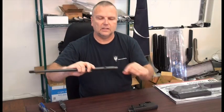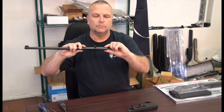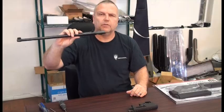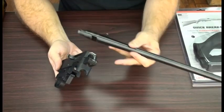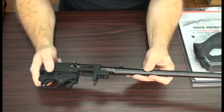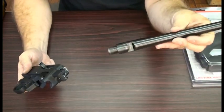After you get the barrel off, you're going to want to take a little acetone and remove any debris that is on this barrel — sometimes a little bit of thread lock compound or something like that on it; you want to remove that. You can also clean any debris from the inside of the action. If it's a little tight, just installing and removing it a few times will get you a nice slip fit.